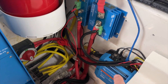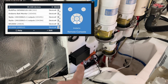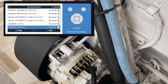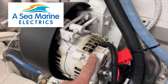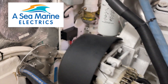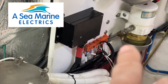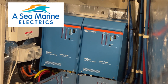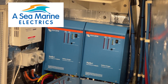We're running all this on the CAN bus — there are quite a lot of devices in this boat on the CAN bus. We've got a MultiPlus 24, 5,000 watt. We've also added two Safari alternator controllers, both on the CAN bus, running off these 24-volt alternators. We modified these — very simple to do. We took the cover off and just exposed the connections at the back so that we can externally regulate them. You'll see the WAGOs — all lined up and plugged in, and Nick has done all this. The Skylla chargers are also on the CAN bus, and they're charging the start batteries at 24 volts while we're on shore power.